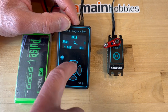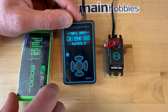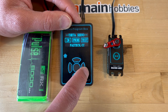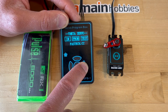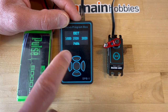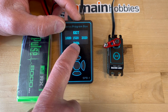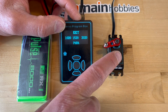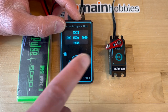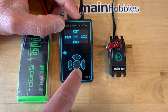I pressed the UP button to EXIT, so now I go back to the original menu. Let's not go into programming yet — let's go into TEST. This actually allows me to test the servos, so I'm going to press TEST. It always defaults to 1520, so I'm going to change the parameters, because I already changed these servos from 1520 to a 760 microsecond center pulse.